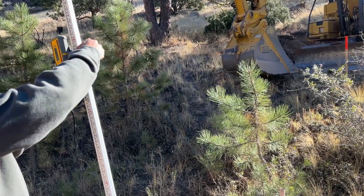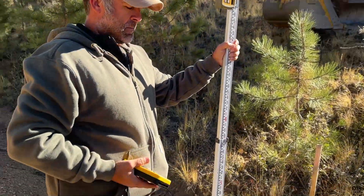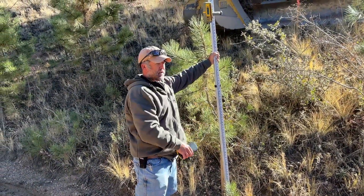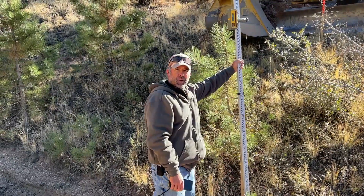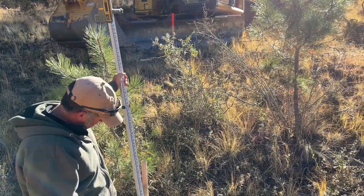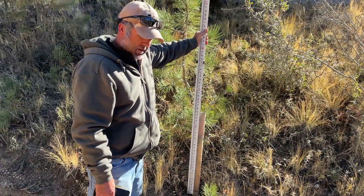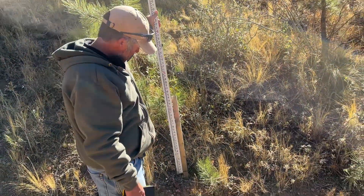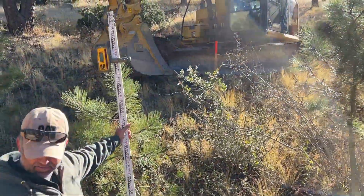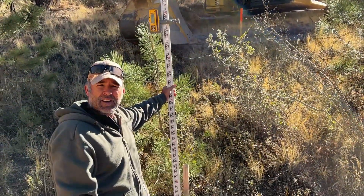Okay, so we'll say about five foot ten, which is just an arbitrary deal — that's basically from there. So then from here, no matter where I move this stick, it'll go up at a 4% grade, and it'll also stay parallel with the road. Kind of funny — I have my mark already there from when I did the survey work before, so my mark on that stake was where I felt I needed to be, and we're within about an inch of that.